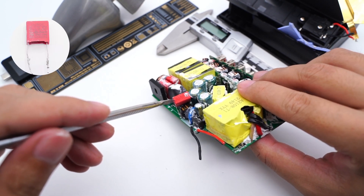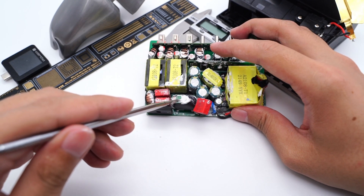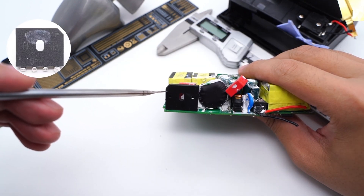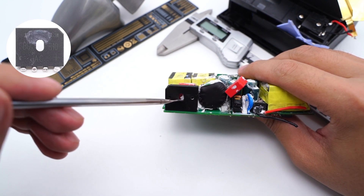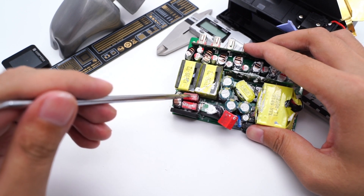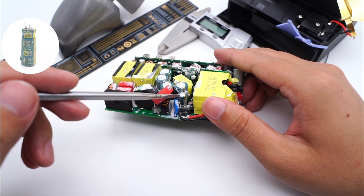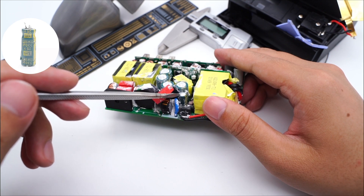A blue varistor is behind the fuse, used for overvoltage protection. The first common mode choke is wrapped with heat-shrinkable tube. The safety X2 capacitor is from Jerk, 0.47μF. The second common mode choke is also wrapped with heat-shrinkable tube. The bridge rectifier is from JFG BU810, used to convert AC to pulse DC: 8A, 1000V. Two film capacitors are from Jerk, 0.47μF, 500V. The toroidal inductor is next to the film capacitors, used for input filtering. The tiny filter capacitors power two main control chips: 25V, 330μF.